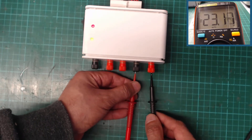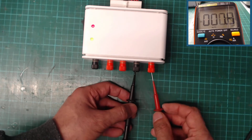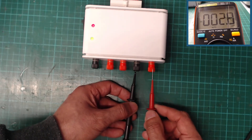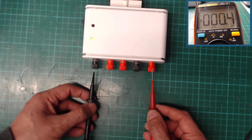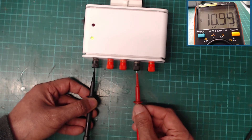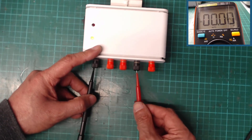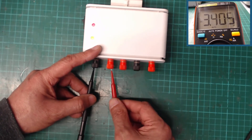Let me just see what I get this way. With both of them I'm getting like 23 volts negative. If I plug it the other way around, I should be getting positive — yeah, about 23 volts there. So combined I get 23 volts. If I use the black probe on that and the red probe on that, I will get 24 volts — well, 23 volts exactly. And if I use the end one, I should be getting 12 volts on that one. It's a bit low on that one. That one should be — yeah, that's the 12 volt one. So that is about 11, that one — 11 minus 11. Then we've got 5 on that one and 3.4 on that one.